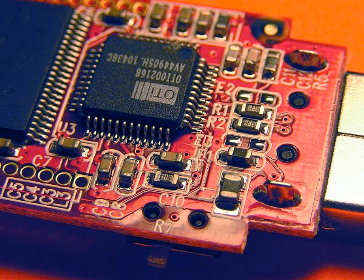Reworking usually corrects some type of error, either human or machine-generated, and includes the following steps: melt, solder and remove components, remove residual solder, print solder paste on PCB, directly or by dispensing, place new component and reflow. Sometimes hundreds or thousands of the same part need to be repaired. Such errors, if due to assembly, are often caught during the process.